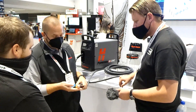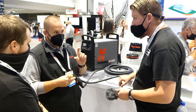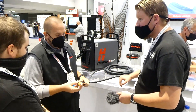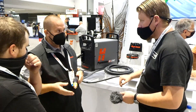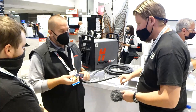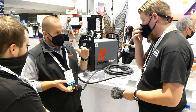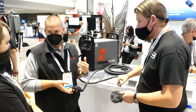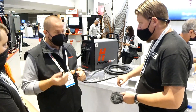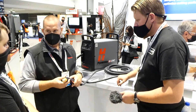What is the longevity between the cartridge and a full stack of regular consumables? We have two types of users: mechanized cutting table or portable automated device, and folks that hand-cut. When we test at Hypertherm in a lab automated environment, we're seeing from the 65 up to the 105 about a 30% to 50% improvement. When hand-cutting through our field trial sites, some customers are getting up to double the life with the cartridge on their consumables.